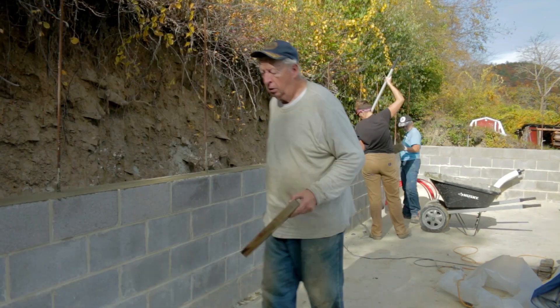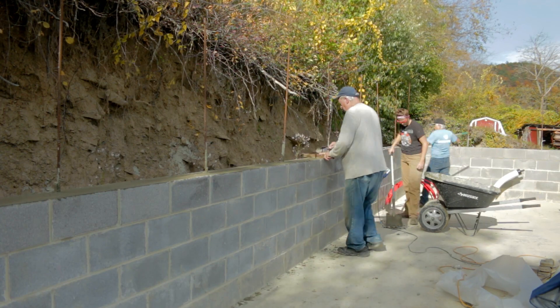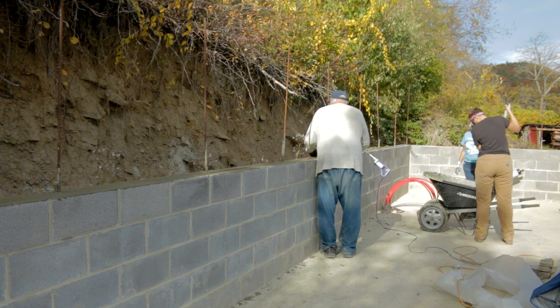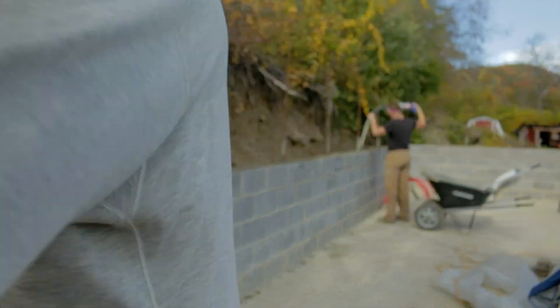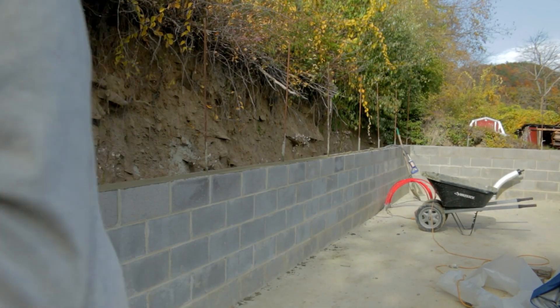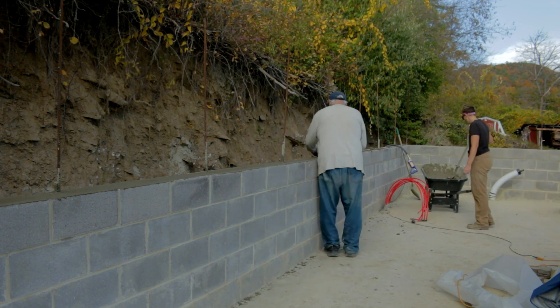My wife and my mom are filling in that top bond beam and my dad is going along through and smoothing out the top and also vibing that concrete down in. That's really important — we want the rebar in there to be fully encased with the concrete, so the vibe is kind of a must for that. It really gets it knit in there really well. He's smoothing it out — it doesn't have to be perfect, it just has to be not lumpy, especially where the block portion is. Because when we come back to set our new course, we don't want anything messing up with that. So we knocked those portions out, set the rebar in, and then just filled it in. That's all a bond beam is. However, doing this with the vertical rebar makes this building incredibly strong. That's the importance of bond beams.